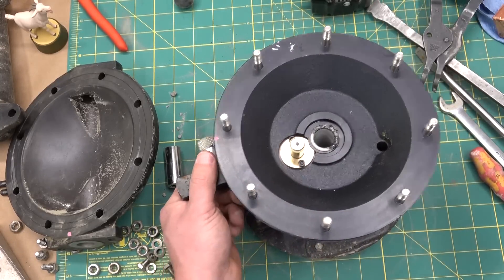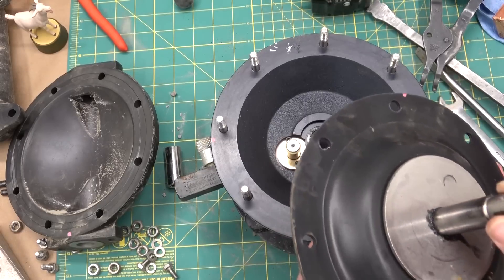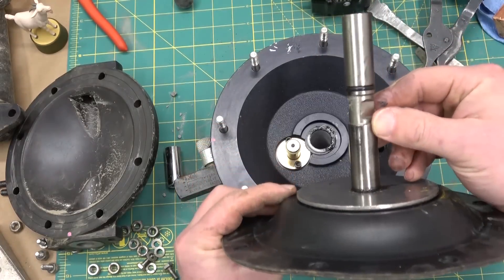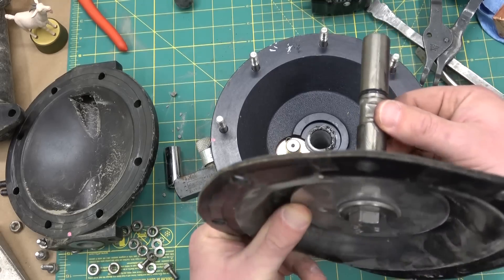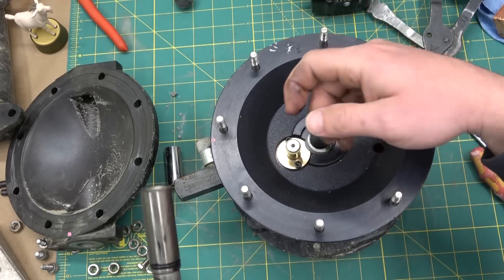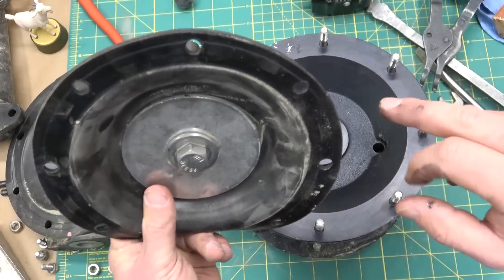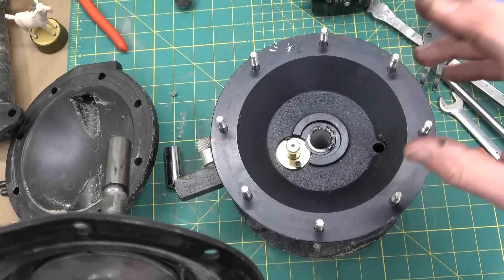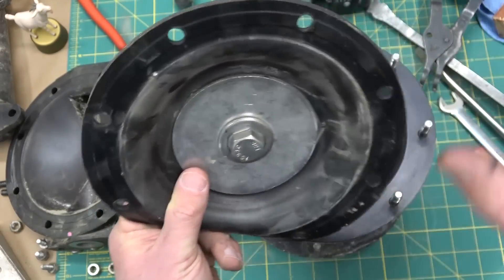The air circuit is what's complicated in this — not very complicated, but more so than the liquid pumping side. This looks like a valve, but it's easy to mistake. It's not a valve — it's just a mechanical connection, just a connecting rod. That's all it does. It goes in here in this — not nitrile, that's the material. That 2-2-2 designation means you can get these for all sorts of applications and different chemicals. You can get nitrile balls, stainless steel balls, Viton seals, all sorts of different stuff.